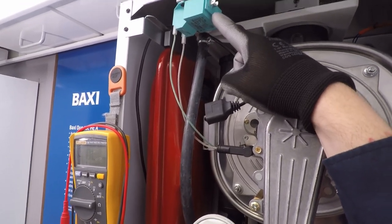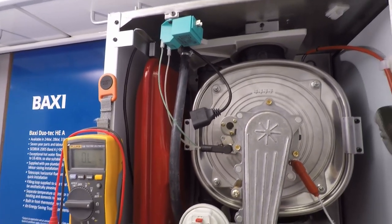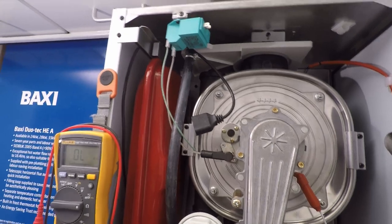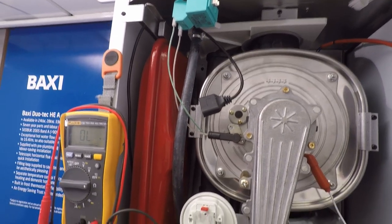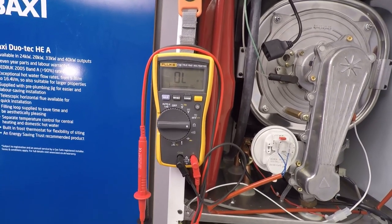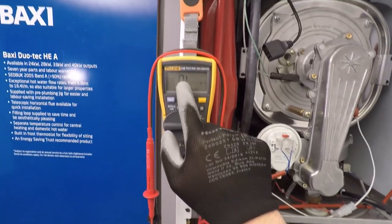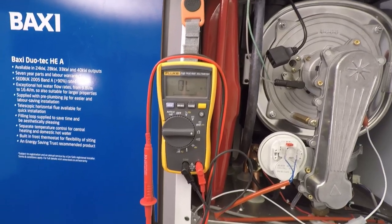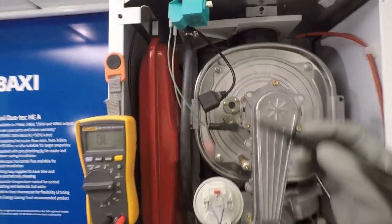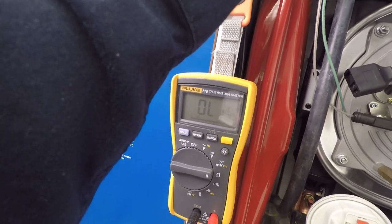The resistance of that generator is three million ohms — or three megaohms — which you can find by phoning tech support or from our engineer manuals if you've been on a training day. It's important to know your multimeter, because some only go up to two million ohms, so they won't show a three megaohm reading. This multimeter reads up to 40 million, so I should be able to get a reading. Going across those two pins — it's showing open line.